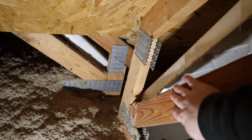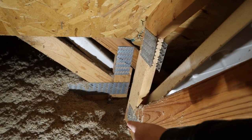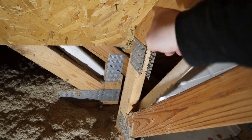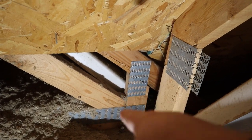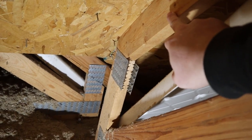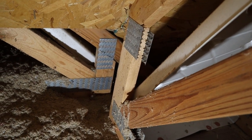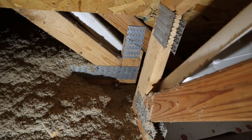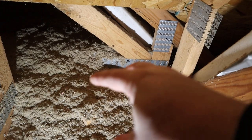Right here is the end of one of my roof trusses — I wanted to show you the heel. Basically from the top plate there all the way to the roof deck — it's a really tall heel height. Over there is a 9-12 pitch, and this one here is a 12-12 pitch which actually sits higher, but the main reason is that the two roofs join at the right place to allow your soffits to be the same size. That's your heel height — what establishes that distance between your roof deck and your top plate so you can put your insulation on top of it. And looking through there, you can actually see my vented soffits.